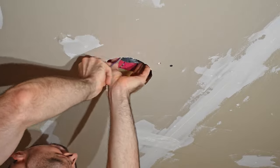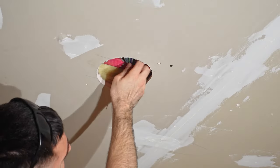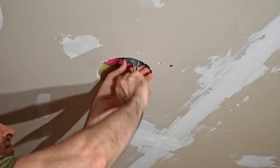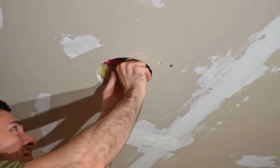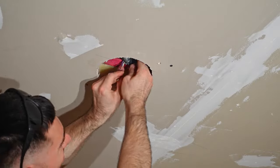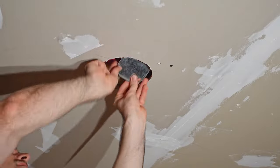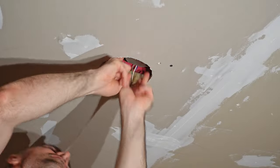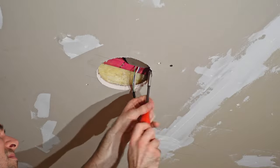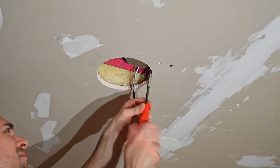So I've left the boxes in place, and I'm going to correct the past mistake by capping the box and putting it back so the conduit stays in place. Because I'm capping the box, I need the wires to come out through the side now, so I need to install a knockout bushing and wire clamp — something I didn't do in the first video, which I'm showing the correction for here. Now that the wires are fed through the side and clamped down, I'll put the cap on the box. This may not be fully up to code, but it's the best I can do without tearing apart all the ceilings to remove the conduit.